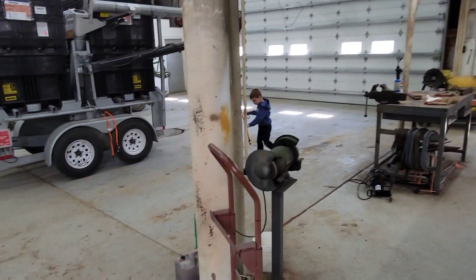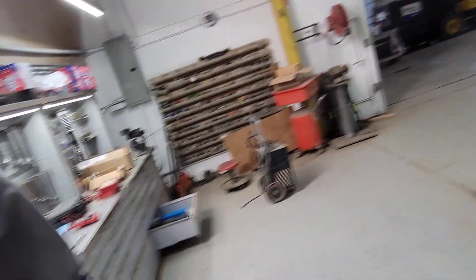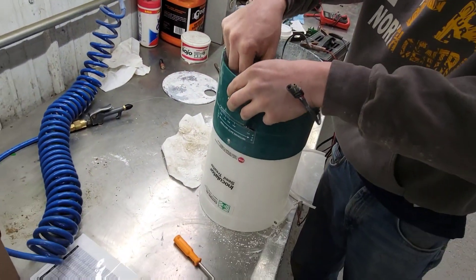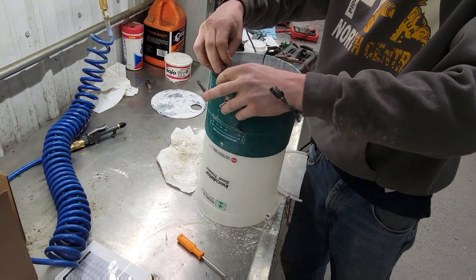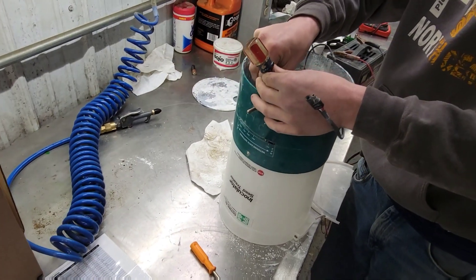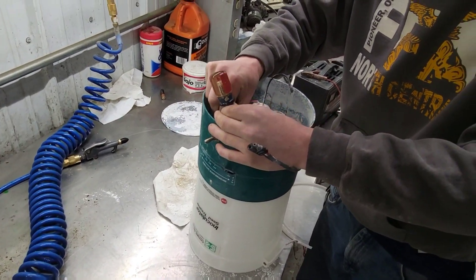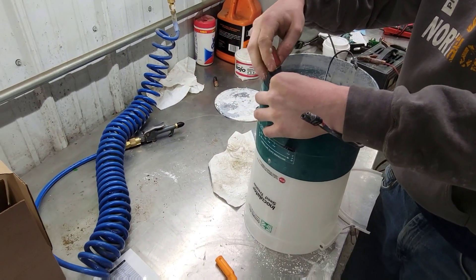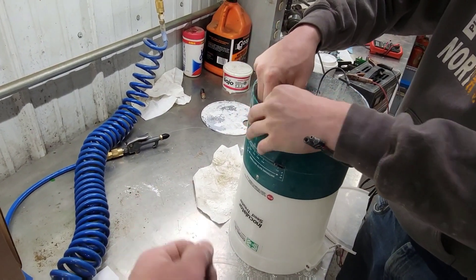We made it back from Berkey. Those dudes are playing with my straps. Brock got here and I had him diagnosing my seed tender motor issues and scale issues. We determined that this switch is bad. That's probably an easy fix because the motor runs when you put power directly to it. But if you go on the other side of the switch and put the switch on and off, it doesn't work.